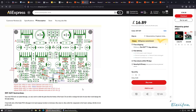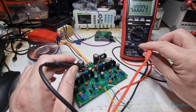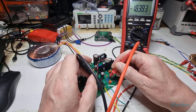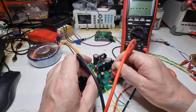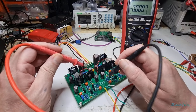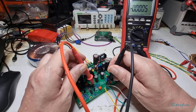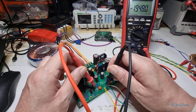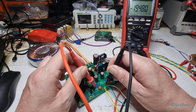We also want to see if we have minus 18 volts here on this 560R, and minus 18 on this 560R, then minus 19.5 here and minus 19.5 here — so we'll take a peek at those to see how close we are. That was supposed to be 18, and we got 18.3, then 19.5 which is 19.48 — good enough. Swapping fingers around: here we go from ground to minus 18 on this part we've got 18.4, and 19.5 there. They're all pretty much there.